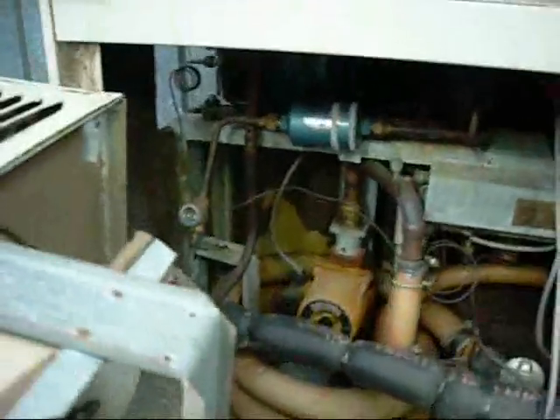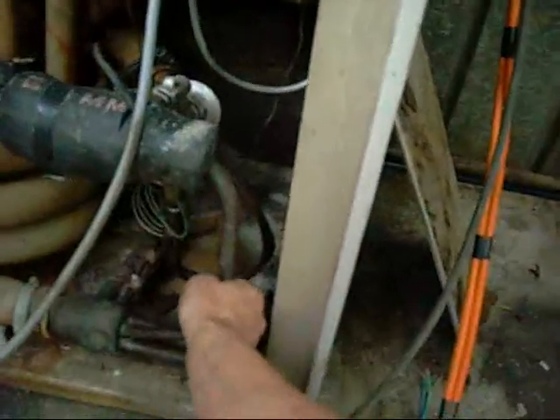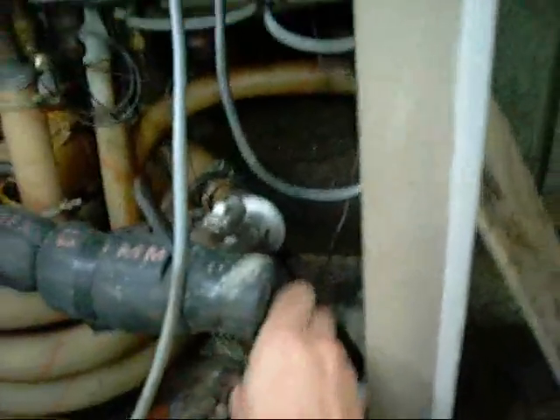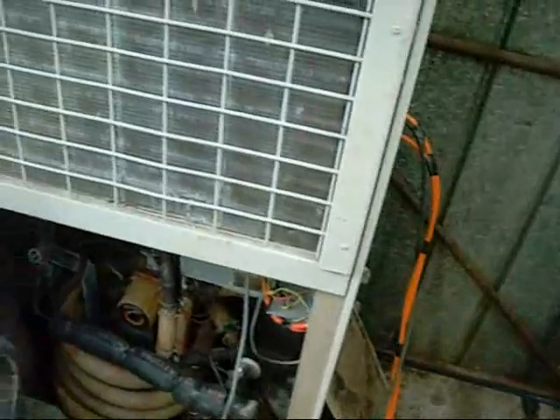Fan's working, lights on. Oh yeah, we're cold — very cold. Cold coming out of the TXV, cold on the return, cold straight up to the compressor. The sight glass has a few bubbles in it and there's obviously no airflow going through this coil. That coil gets hot quick — really hot. This one's going to be a good runner.